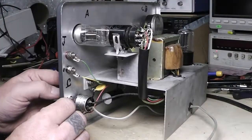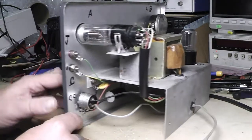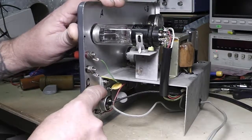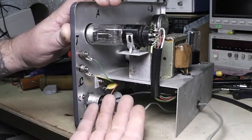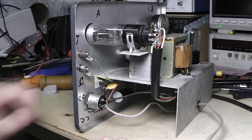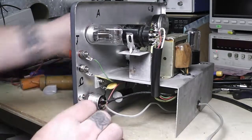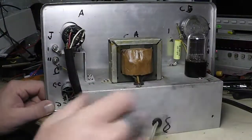Check or change any screws as needed. Another thing: if you get this one loose on the front — it comes through right in here — if it's loose, this would be loose. This is our safety capacitor so it'd be not that big a deal, but something else would lose its ground. So when you do a restore on these things, just go through and check your screw tightness.